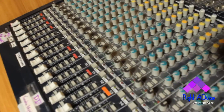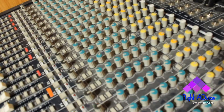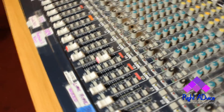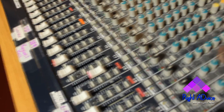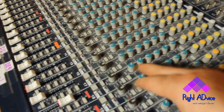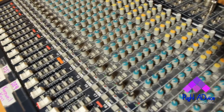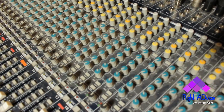The laptop and iPod cord input is on channels 25 and 26. If someone wanted to hear a particular device — mic, instrument, or MP3 player — on the house, you would turn up that channel fader. If someone in the monitors wanted to hear that signal in monitor 7 and 8 or monitor 2 over by the keyboard, you would adjust those auxiliary knobs up to about 11 o'clock. Those are aux sends 2, 7, and 8, with 7 and 8 being the last two at the bottom.